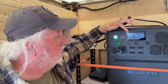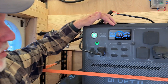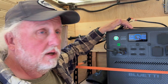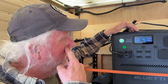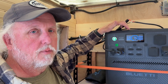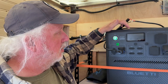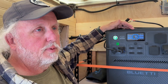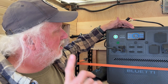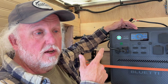The sun just partially broke out, so I plugged back in. I'd had it unplugged to drain it down to get a good idea on the charge. We're breaking 200 watts even with pretty heavy cloud cover. The best I could get with panels all wired in parallel was 160 watts — usually 153 was the highest. So breaking 200 with cloud cover is promising. These panels are also almost 10 years old and ambient temperature factors into charging efficiency, but when the sun is truly hitting it and not cloudy, it should be even higher. I think we've got the problem solved.